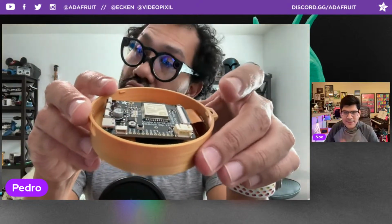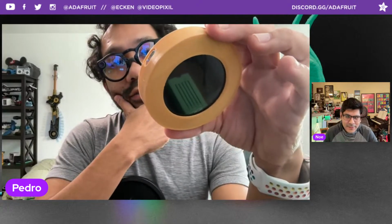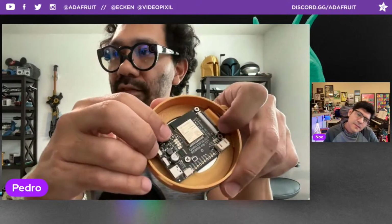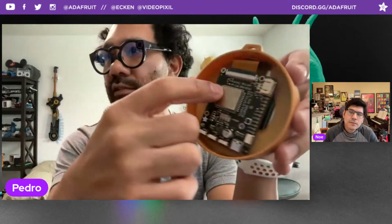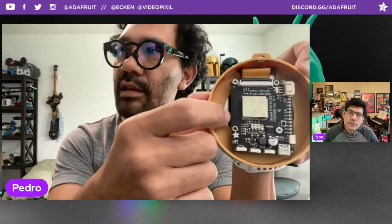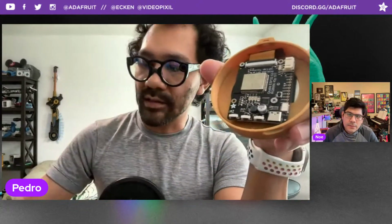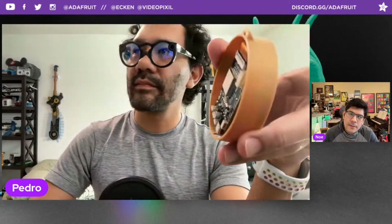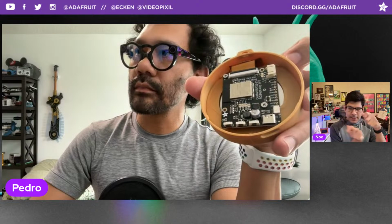We're making design decisions right now. Maybe you can add some mounting holes, some standoffs on the back cover. Since I'm only using 2 here, you could piggyback off the other 2, make another holder down over, I think, underneath the chip here. There should be a nice amount of space down here. Otherwise you have to make it taller, and you can't really shift the board because then the ribbon cable will kind of come at it weird.